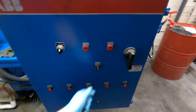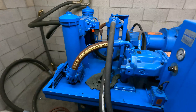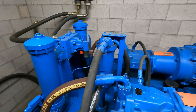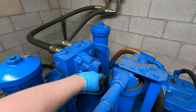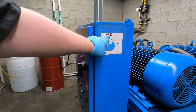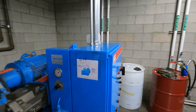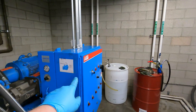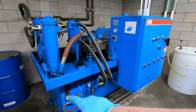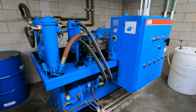The arrow is on clean, so this filter is good — we don't have to worry about it. Turning it off and trying motor 2. That one is good too, and its indicator is on the other side. This unit is for towers 12 to 15, and over here we have towers 16 to 19 — left side and right side of the press. We're going to do the same thing: make sure it's topped off, top is clean, run both motors, and check the filter elements.